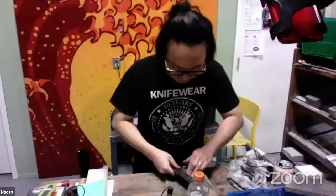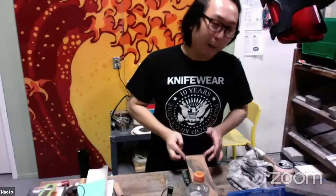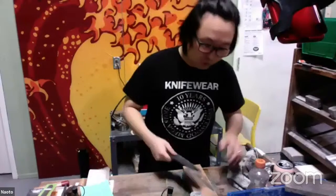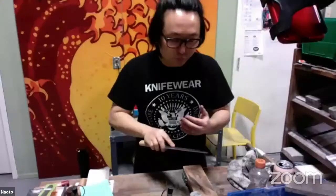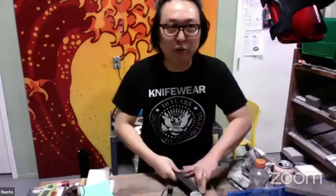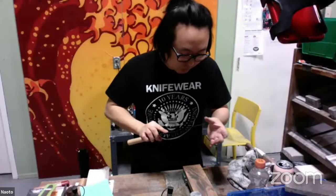Right now I've moved up to a softer 1,000 grit stone. The softer 1,000 grit is good because it touches on the low spots as well — since I've already sharpened out the high spots, I don't have any remaining. This softer stone gives the knife a really nice smoky look. From here it's more about appearance than performance.